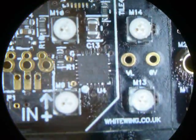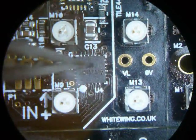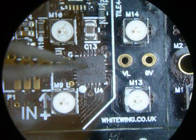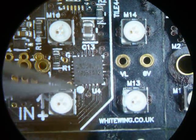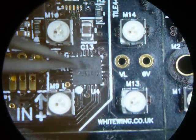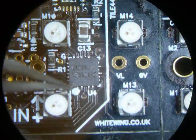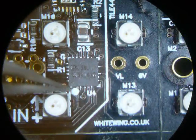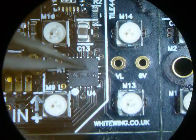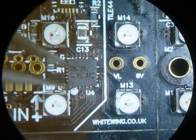You'll see it start to melt. The trick is to just give the chip a little gentle tap. Once all the solder's melted, it will tend to find its own position on the pads. The tapping also tends to remove any voids if some of the solder bumps you put on there weren't quite as high as the others.